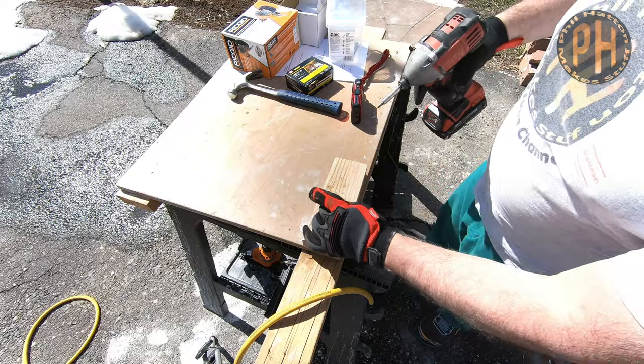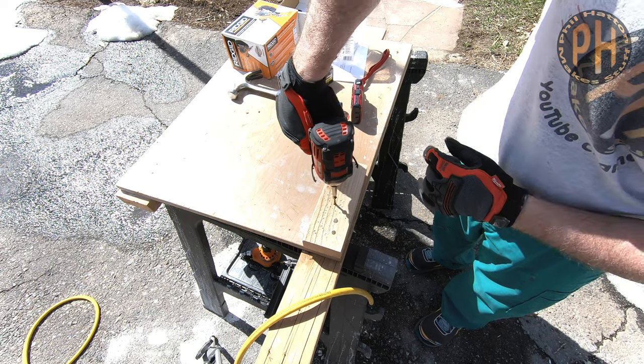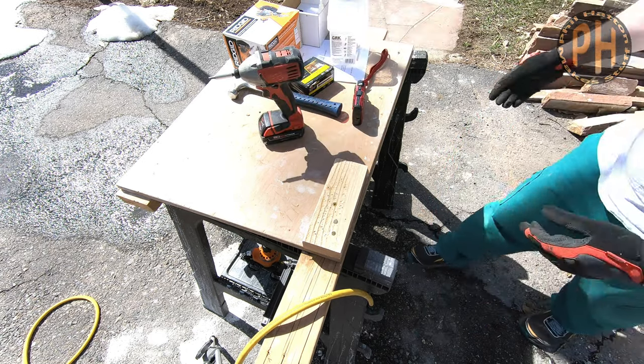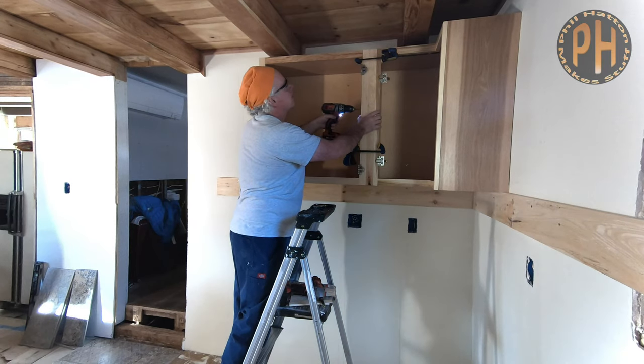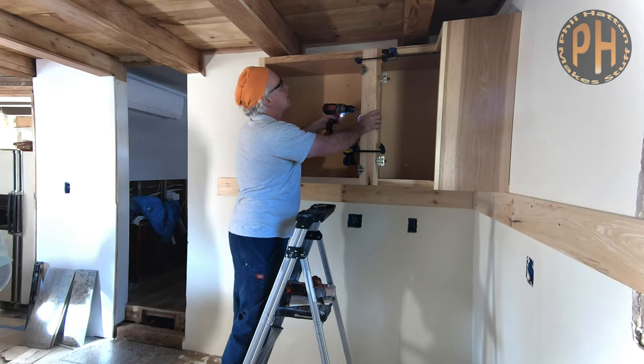We used the cordless drill and cordless impact driver to install cabinets, screw blocking to studs, and drive the structural joist screws we used for joists, and to quickly knock up a closet wall where, strictly speaking, nails weren't required since the walls were partition walls and non-structural.